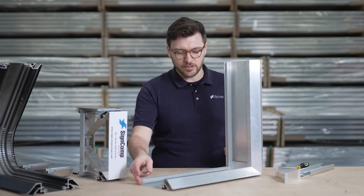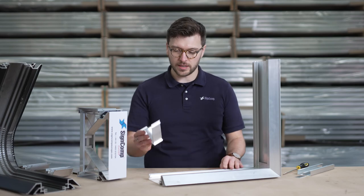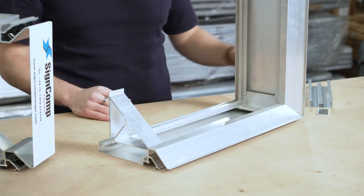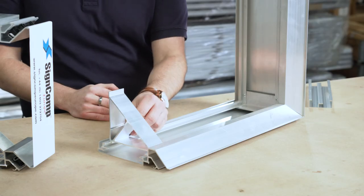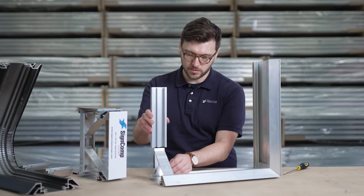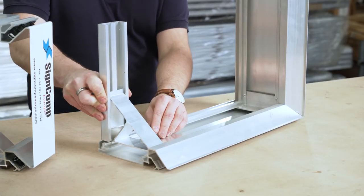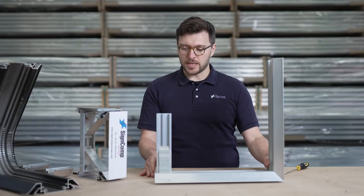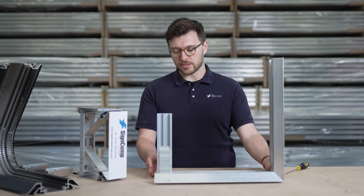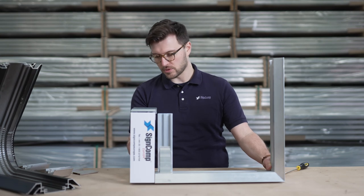To further demonstrate our internal structure, I'm going to show you the gusset support again. Hook into place like I showed you. Locking plate again — slots there. And your internal back support slots into place like so. You would place an internal support every metre, and if you're building your box in sections, you would have a support on either side — just like so.